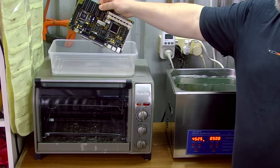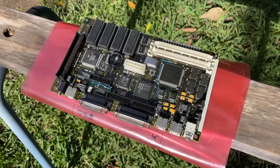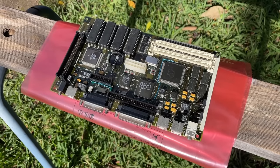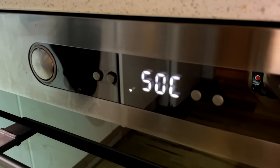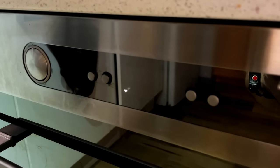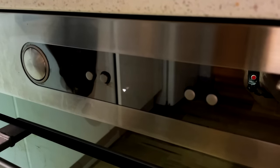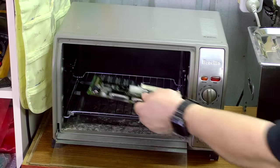Once it's rinsed, I let the excess alcohol drip off the board, then I dry it. You can dry it under the sun, but if you want to speed up the process, you can dry it in your household oven — though you must be able to set your oven at really low temperatures, which pretty much rules out the use of a gas oven. I use a little toaster oven that I picked up from Goodwill for about $30.